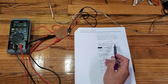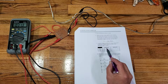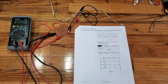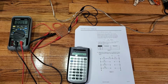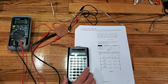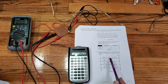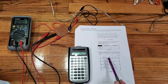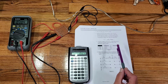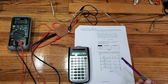Using this voltage, calculate the voltage drops across resistor 1, 2, and 3 and record them in table 2. We have a calculated column and a measured column. We get our meter set up in engineering mode, three decimal places. We're going to look at our resistance values: a 1 kilohm resistor, a 2 kilohm resistor, and a 3 kilohm resistor, all in the same path. This is a series circuit, so we simply add these values: 3 plus 2 plus 1 equals 6 kilohms total resistance.